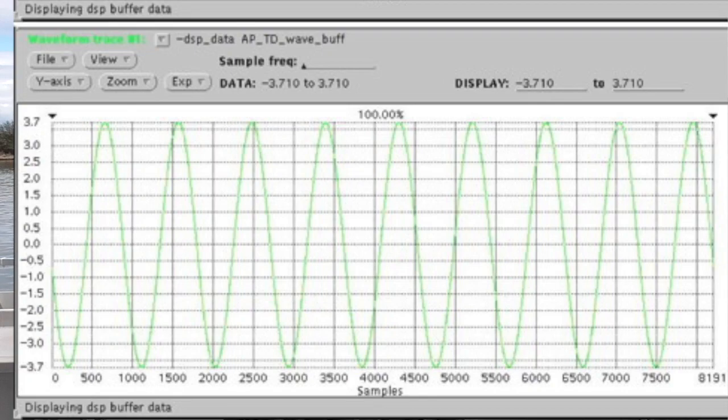So I did the FFT on it, threw away everything that wasn't in the 10 kilohertz bin, and then I did the inverse FFT, and there you go, there's the wave, 10 kilohertz. That's my 10 kilohertz wave. When you have a single tone, you can absolutely guarantee that the relationship between the peak and the RMS is 0.707. Guaranteed, absolutely. If it's a pure sine wave. But if it's not, if it's something else, there's no guarantees. But the guys at Raytheon didn't know that.